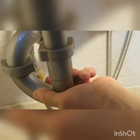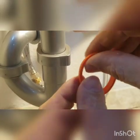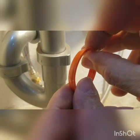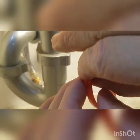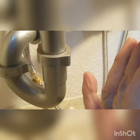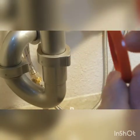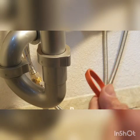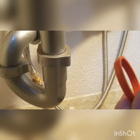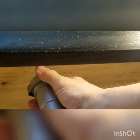Put this in here so it's in place. I may need a red one — the red ones are a little smaller. What I like to do is take a little petroleum jelly — a little Vaseline — and go around just the outer edge, not the inside. That helps preserve it, keeps it flexible, and helps prevent it from drying out so it will last longer for years to come. But don't get any Vaseline on the back side — wipe your hands off and don't touch the inside with the hand that has oil on it. Keep the inside perfectly dry.